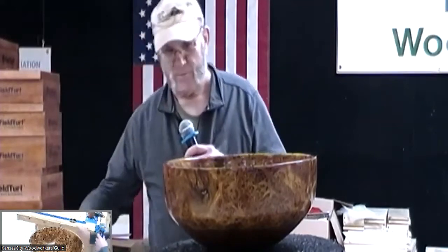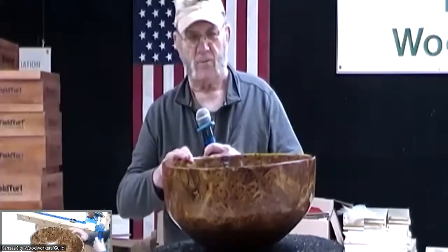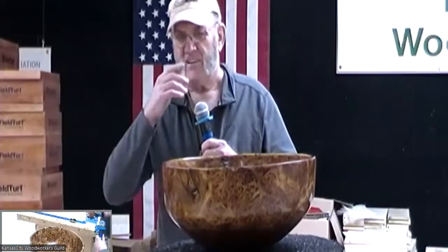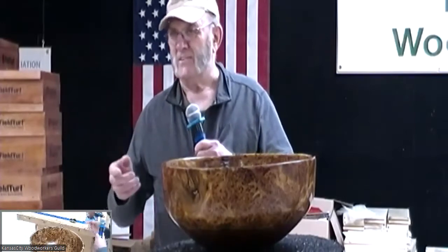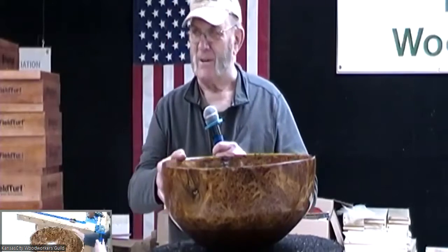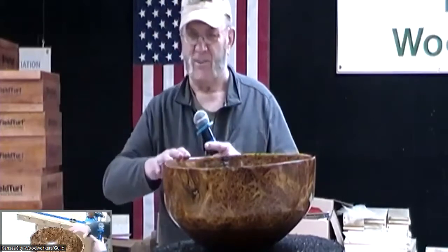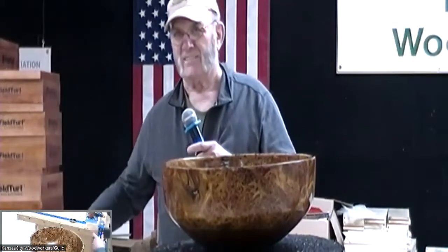But it's a barrel. So now we are faced with, what do we do to get the lathe working? Now, this ties up your lathe, so you're not going to turn anything else while you're working on this. So I got on eBay, and I found a really good 10 RPM motor that was used in some medical device for $13, and I adapted that to my lathe. So you've got two chucks, one on the inside for inside turning, and this is now on the outside because it's 18 inches and 16 inches is my inside depth.